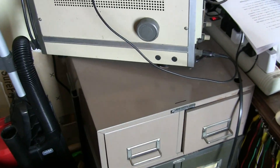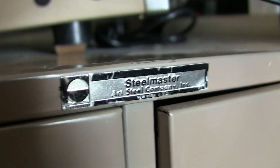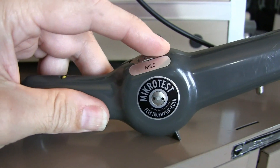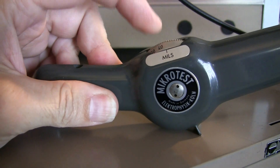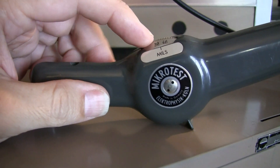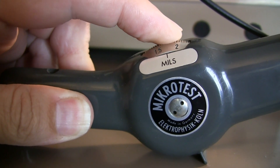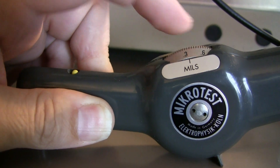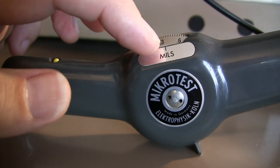Here we are in the lab right beside the desk. I've got a set of little file cabinets here — these are steel, made by Steel Master — and we'll do the same thing to give another idea of relative thickness. These are actually painted steel, so this will measure the thickness of the paint. With the device held flush against the object, we slowly turn it downward: 3 millimeters, 2 millimeters, 1.5, 1 — and there it came up. So when the probe overcomes the resistance, it tells you the actual thickness. On this, it's about 0.3 millimeters of paint.